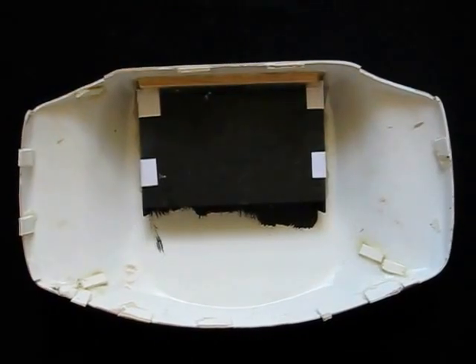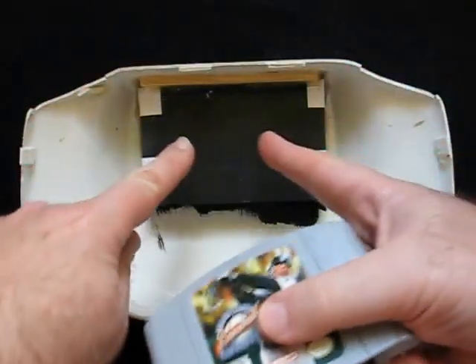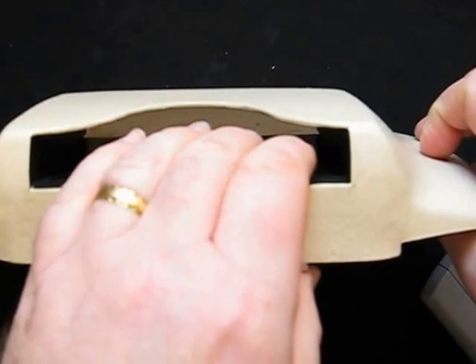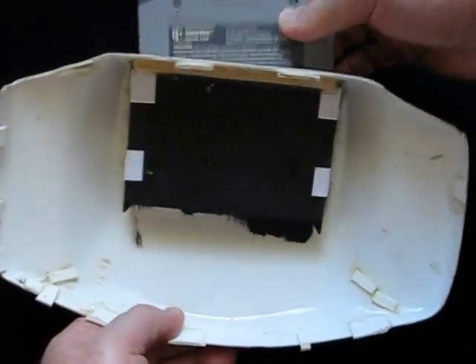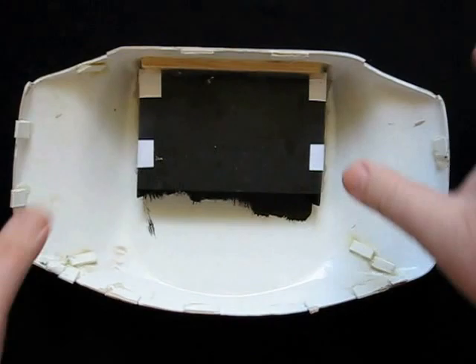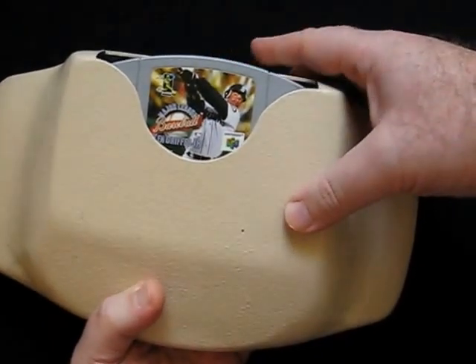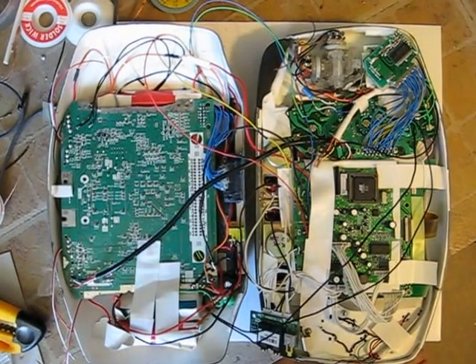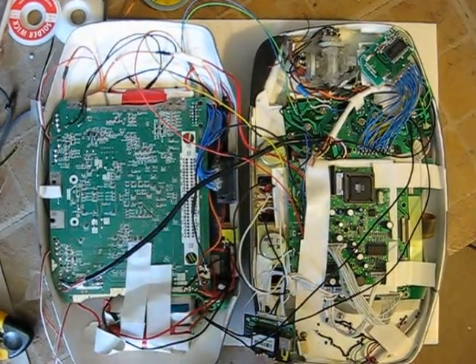When making your cases, one option is putting the game cartridge to stick out at a right angle or at the top of the system, but I prefer having the cartridge integrated inside. All you need is a suitable hole to accept the cartridge, a carrier for it to sit in, and a way of securing it in the back so the game pushes in properly and stays in place. It can look very attractive when the cartridge is internal. When designing the layout, make sure everything fits, looks tidy, and that you can get back into the system later for repairs — all components should be secured down and wires kept no longer than necessary.